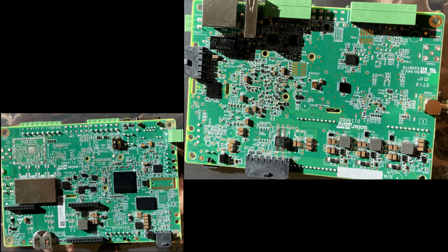So before my electrician shut down the inverter one last fateful time, he had trouble trying to set the CT value on the Modbus meter. He would set 100 amps and it would automatically reset to 0 amps. And my conjecture, and it is just a conjecture, is that parameters became conflated and maybe the software became corrupt as a result. I believe this is a software corruption issue.